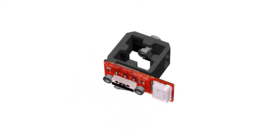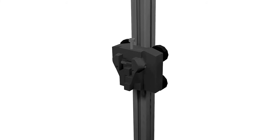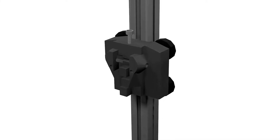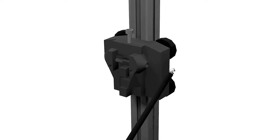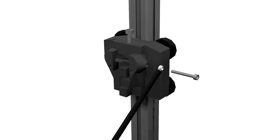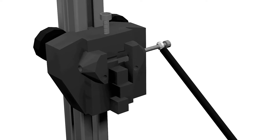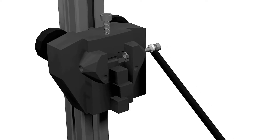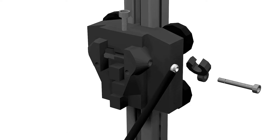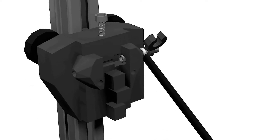Now we'll add the arms to the carriages. We'll use five M3 20mm bolts, one M3 25mm bolt and six M3 hexagonal nuts. Slide the M3 bolt through the ball head buckles and in through the carriage side openings. Place an M3 hexagonal nut on the inside and fasten the bolt until it bites the nut and is tightened correctly. The grip should be firm and there should be no play on the ball head buckles. Add the cable holder for the right side of the X carriage and use an M3 25mm bolt instead of 20mm.